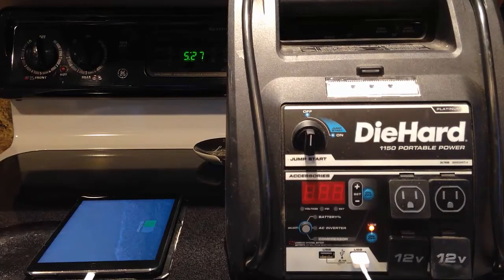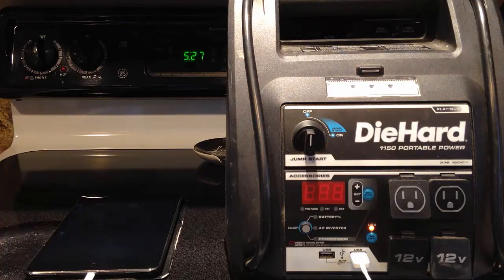So what did this prove? It wasn't a scientific test, but it does demonstrate that when you hook a high-load device to the Die Hard or Schumacher battery pack, these small batteries have trouble keeping up. You should only run it for about 10 minutes at high load, then give it a little rest if possible — that'll extend the battery life through the day. You'll presumably be charging it via solar, cigarette lighter, or some other way. Based on this, you probably wouldn't want to run a high-load device like an electric heater on one of these packs. However, I'll show you in the next video a trick that lets you run a small electric heater and get extended use out of one of these battery packs.